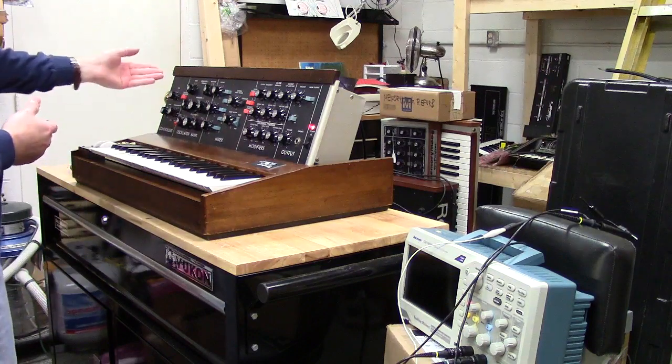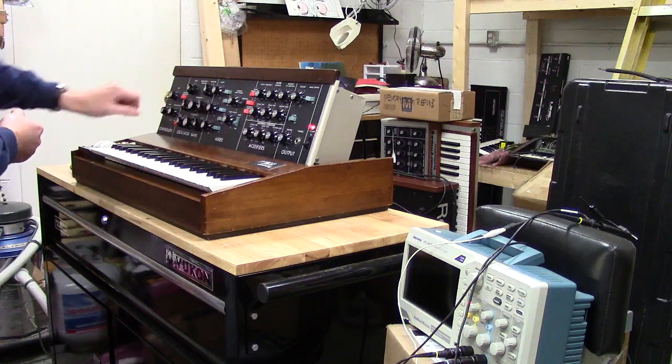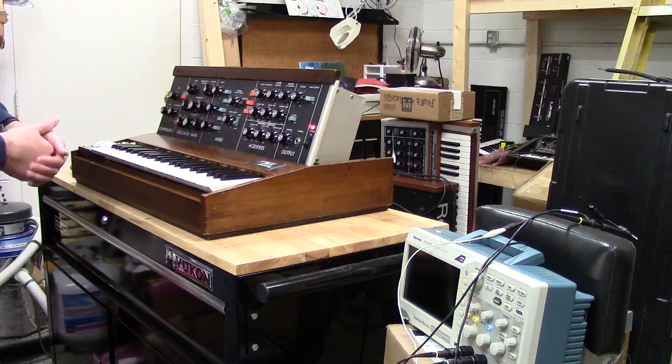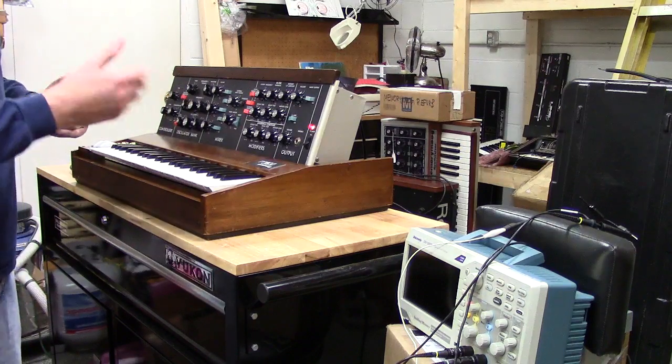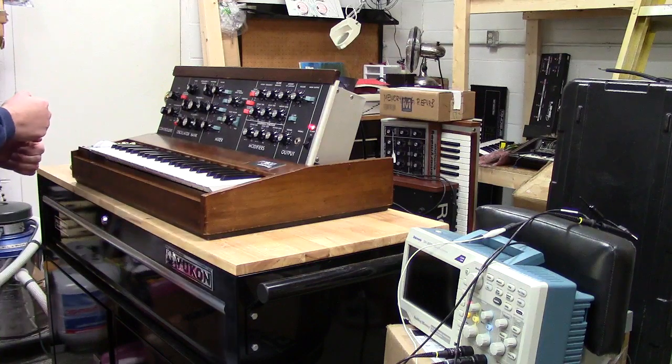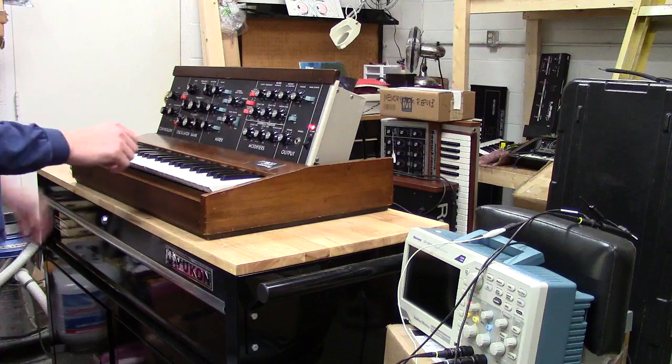And that's why you have that. You change loads on those resistors when you change your octaves, is what it really is. It's just a load change, and when you change the load, it affects the other oscillators because it's taking some off that load. But that solves every bit of that problem. But anyways, as you can hear, I'll just play it for you.